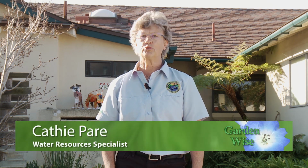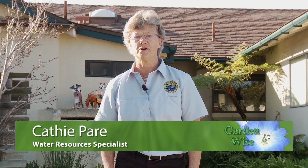Today we're going to talk pressure in your irrigation system. Pressure is the Goldilocks of your irrigation system. Too much pressure and you're going to see misting. The water's going to blow off site and it's totally inefficient. Too little pressure, your sprinklers don't pop up.